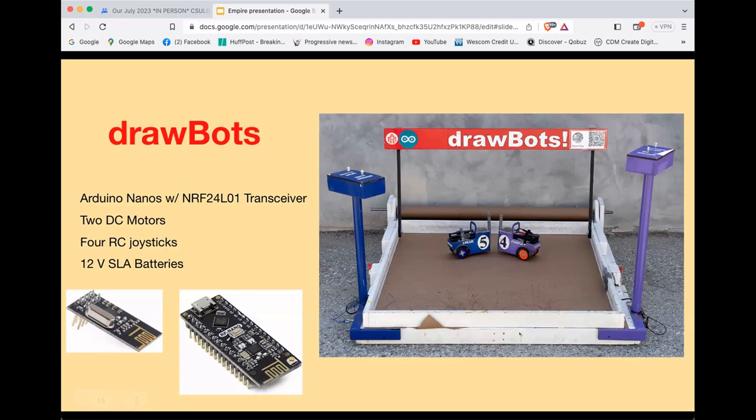There's a transmitter here that's connected to this, there are wires that go down and wires that go up. So this Arduino under here is transmitting a signal to each of these. Is it digital serial communication or the standard RC PWM? It's RF, just radio frequency, 2.4 gig. So it's digital. I didn't know if it was a standard RC like you fly a plane, which is a PWM analog signal. So you basically have to write your own serial.